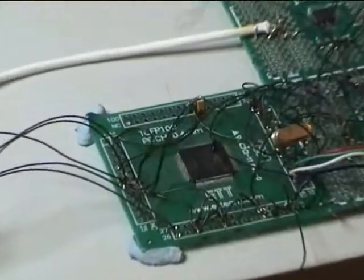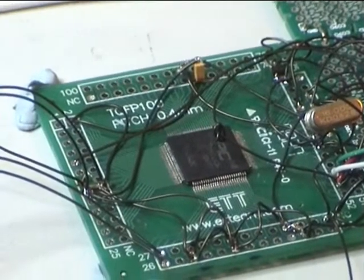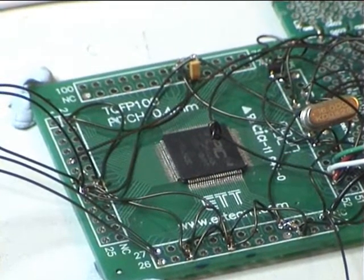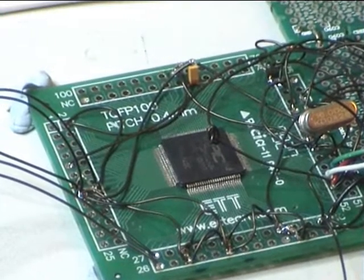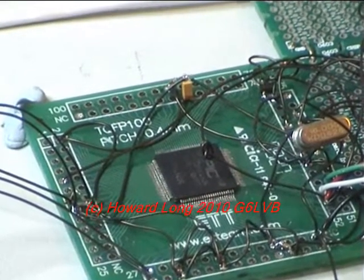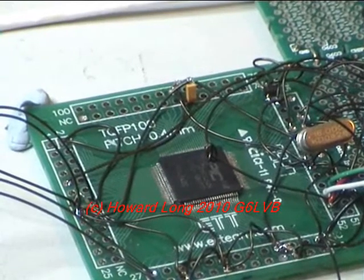This biggest device here is a PIC32 — as the name suggests, a 32-bit device. We're actually going to look to see if we can maybe use a smaller device to cut costs, but the price of this is around about £3 a part in quantity. As you know, it's a bit scary — there's 0.4mm pitch soldering there, so you need to be a little careful with the soldering.